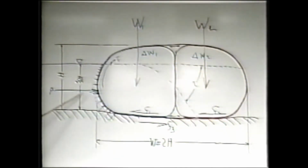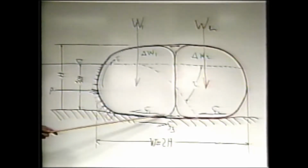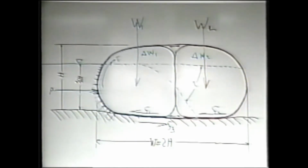When a water structure is acted on by an external force, it is theorized that the torque created by the external water force is transferred from the outer tube to the nearest interior tube. The friction forces between the 3 tubes are equal and opposite, and so prevent the tubes from rolling. Testing is required using electronic strain gauge equipment to fully understand what takes place within each tube when an external pressure is applied to a water structure.